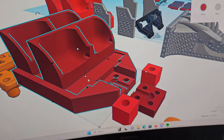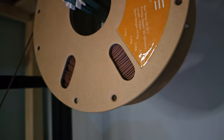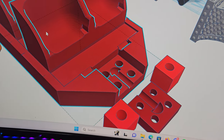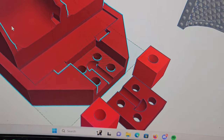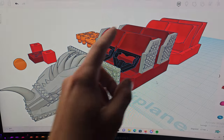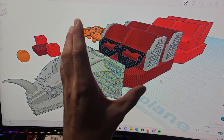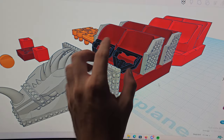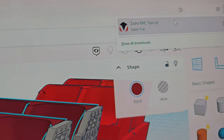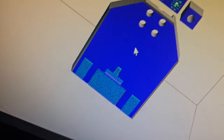We're just about ready to start printing. The printer is set up with the new filament loaded. It looks brown on camera but it definitely has a bit of purple to it. We've got the base which includes the seats and the new coupling I made for the front car. Underneath there's the bit for the chain dog, the wheels, and the screw holes. Once the resin printed parts - the grey bits, black bits, and the front piece - arrive, it's going to look amazing. Let's export this, drag it to the desktop, open it, add some supports, and it's ready to print.